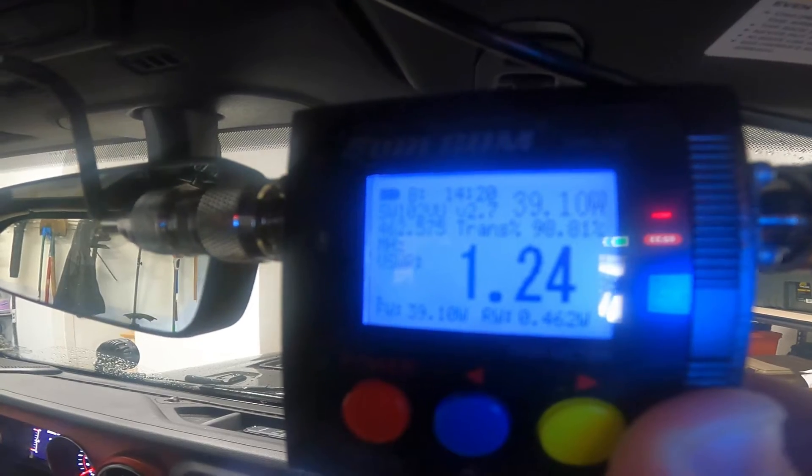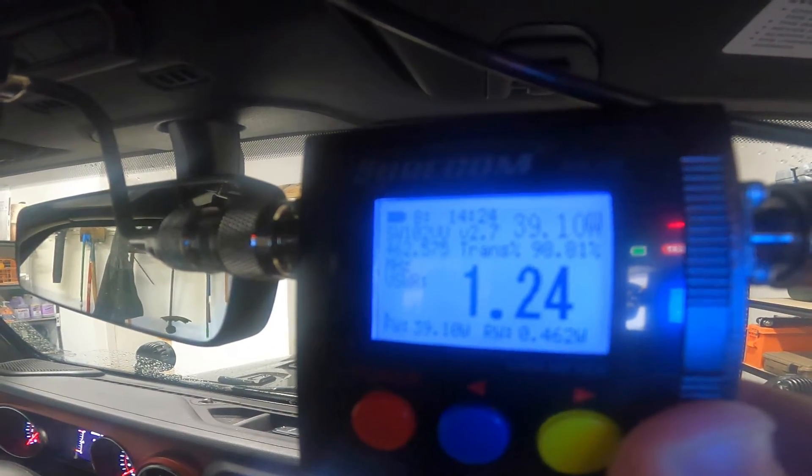And I guess my meter was not fried after all — that is good news. I'm going to close the video out now, take this SWR meter out, plug the antenna back in, and the radio should be good to go. I hope this video was helpful for those of you out there that are new to GMRS or radios in general and maybe have never used an SWR meter or had to tune an antenna. I'm also going to post a link in the description for you guys — if you cut your antenna too short and go too far, you can buy new antenna masts; they aren't very expensive, around $10 or $20. And that is all you really need to know about setting up a GMRS radio and tuning the SWR. I'm Landon with Order of the Traveling Hats — if you like this, please like and subscribe. It helps us out a lot. I hope to see you out there.